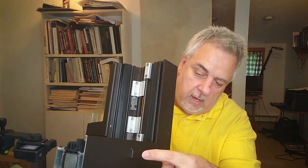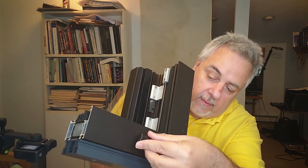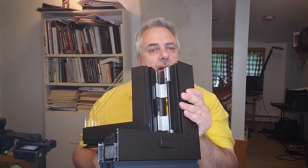That weeping channel gets communicated out. You can pop this off and see the weep channel right there — it comes complete with a nice little hood that goes over the top, so we get a nice aesthetic closure. But even our windows follow the number one rule in water management: down and out. Even when I'm thinking globally about the project, I'm worried about down and out — and that translates to every detail in the project. So even when I'm picking out windows for my projects, I need to ensure that the manufacturer has exercised as much care and intent in water management as I have in the whole house, so that every little piece does its water management part.